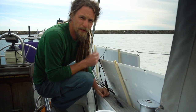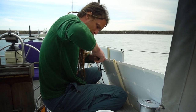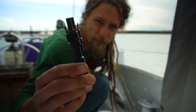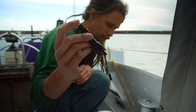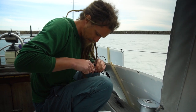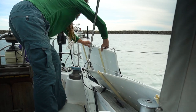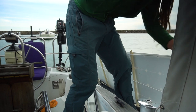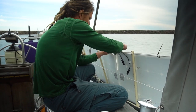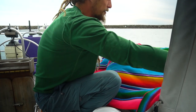I think I'm going to experiment with wiring the solar panels in series — I've had them in parallel but I'm just going to test it out. This is the little parallel connector that allows you to connect two solar panels together in parallel, with one connector each for positive and negative. Just covering the solar panels because they always output when they're in the sun — even though it's pretty cloudy, they're still going to output something, so we're just going to cover them up a bit.